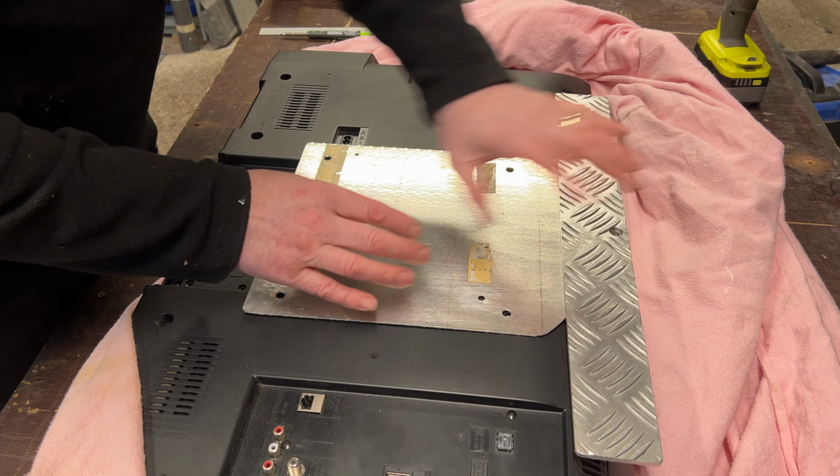Right, I need to set this blade to 45 degrees. I'm using a digital level box. I've done a previous video on this, and it does a pretty accurate setup for what I need. But I can go one step further with it, but let me show you this first. Zero that out on the bed.